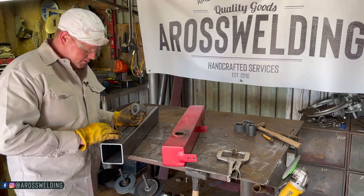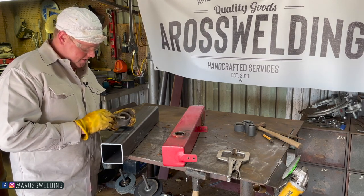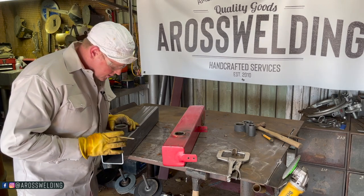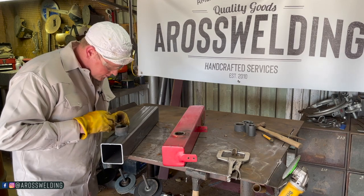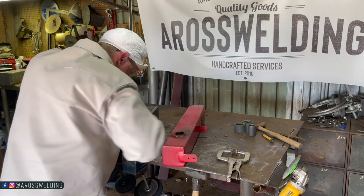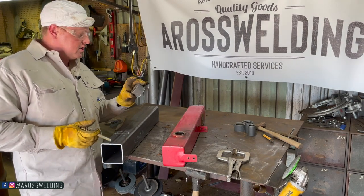So I just found center, and then I measured from the center over half of the diameter, which is 1.25. I measured 1.25, 1.25. And then now I'm just gonna line up the outside of my coupler, or whatever this thing is called. I call it a coupler, but line up the lines there, trace it like so. This is one way of cutting a hole.